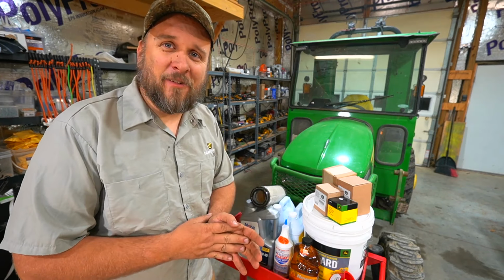Our oil is still dripping into the pan, and because it's an elongated pan, I can go ahead and take the filter out and it's over the same pan. Now, as you do with anything you change the oil on, you want to make sure that you got a seal that came off with the filter. I actually knew someone who blew an engine because the seal from the old filter stayed on the engine block, and they put their new filter on and it had two seals, which doesn't seal at all.